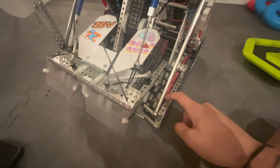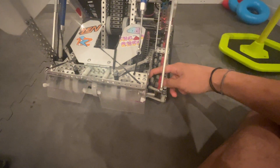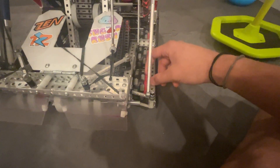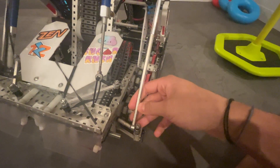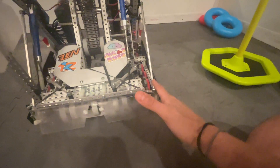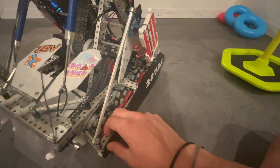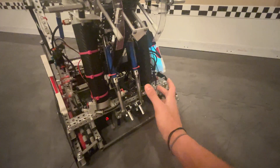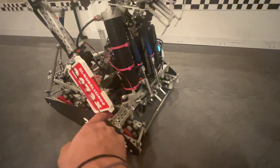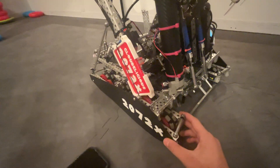The reason we have our gears on the outside is because previously we had structural screw joints — a cap screw on this side and a cap screw on this side. We accidentally tightened them too much thinking it would solve our friction issues, but that only made it worse. So these base C-channels ended up cambering outwards. Before Sugar Rush, we hot-swapped the outside C-channels, added this full-length cross brace, and also added these fully boxed C-channels, which really improved the strength of our base.